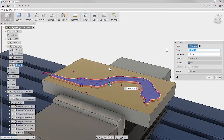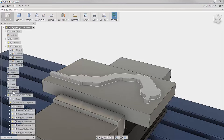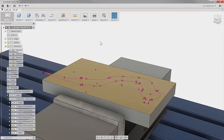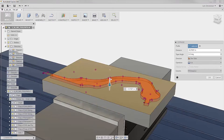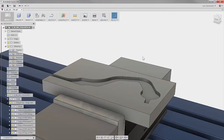So now I can select it and I'm just going to make a cut down here. I've kind of created an imprint and I'm going to make it a cut, not an extrusion up. Now where I've created this, I have an imprint for the part to fall into. But there is a little bit of a catch — anybody who has ever done any machining will tell me this is not going to work as is. You always need some kind of clearance when it comes to fitting a male piece into a female piece. And specifically in this part, there are a lot of round corners that need to be opened up.